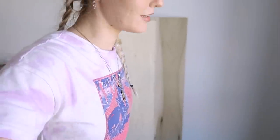I debated doing the screwing of the piano hinge before staining, but I decided against it because that means that whatever part is covered by the piano hinge will not be stained. And I would have to cover up that piano hinge. So we're not doing it that way. I'm gonna set you down. Let's do this part first.